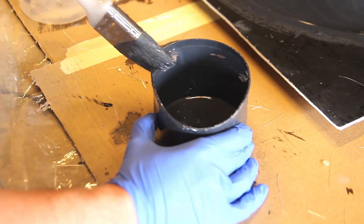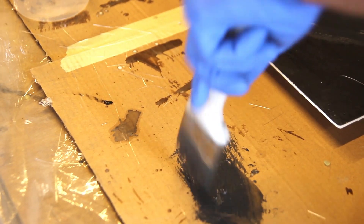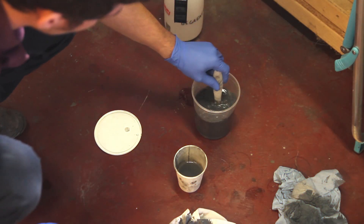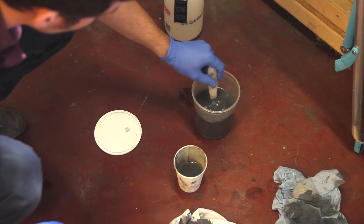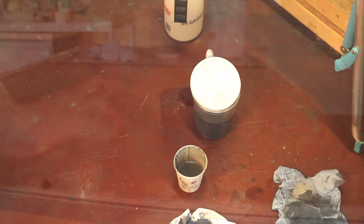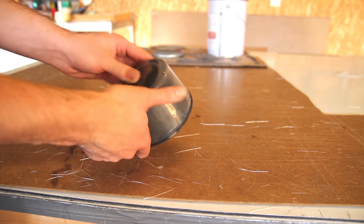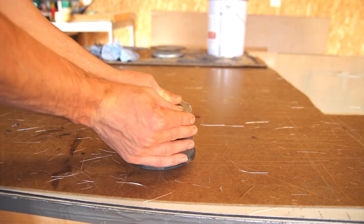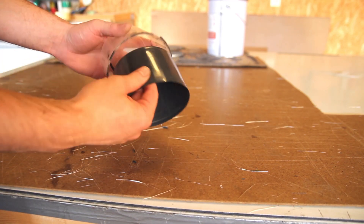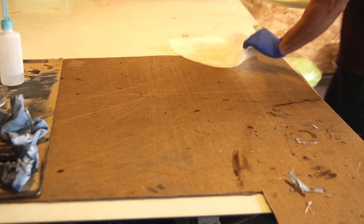Here I'm showing you how you can reuse the cups and the brushes. First I remove as much material as possible from the brushes and add the remainder into the cup. Then I clean them in acetone and let them sit until I'll be using the laminating resin. After a while, the pattern primer left in the cup forms a little liner that you can remove in one go, so the cup is ready to use again.